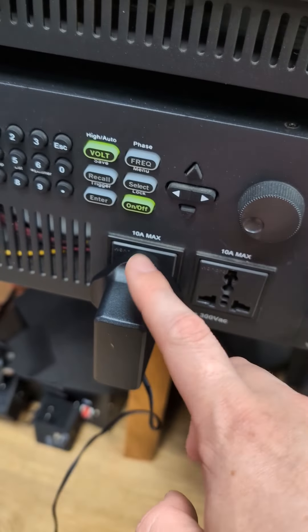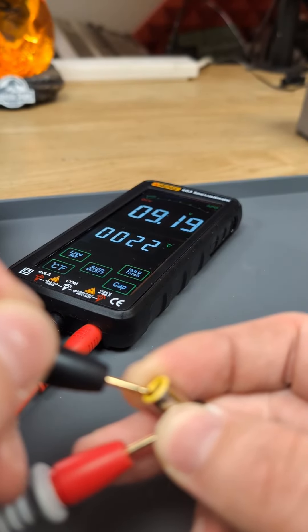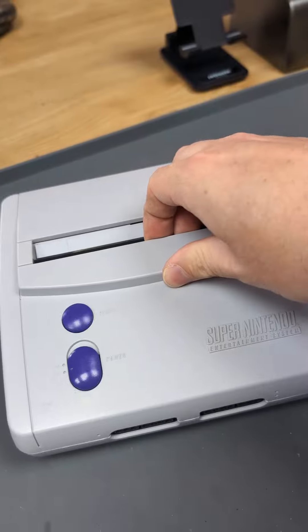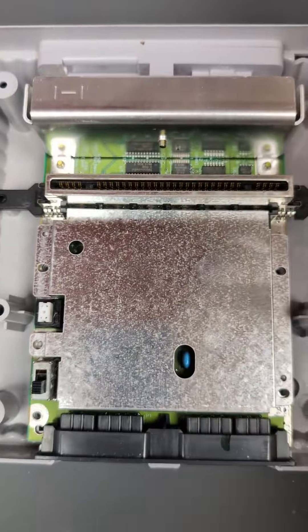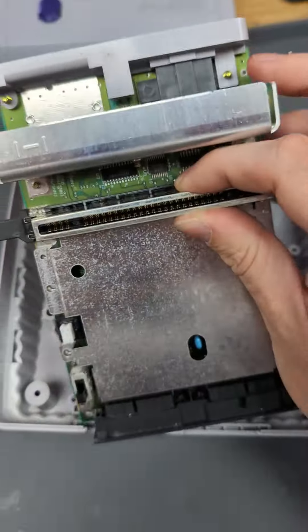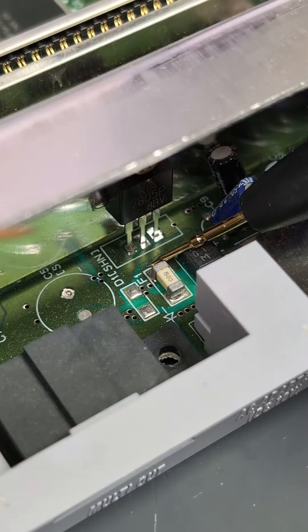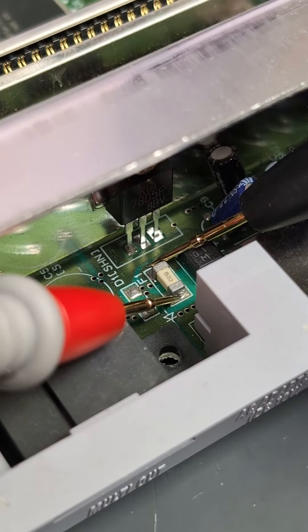The customer supplied another newer power brick, so let's just test that — and this one's fine. Considering he says it's got no power, let's power this from the bench first anyway. If we take a look inside, we can see it's basically just a mini SNES. It's got a very similar layout, just a much smaller form factor. And we can see in here — there's the fuse. That's the first check, and it is a blown fuse, which is rare.